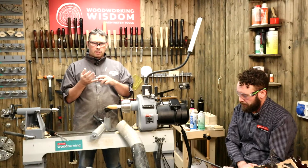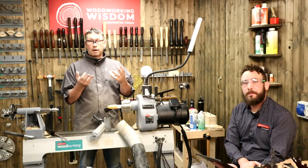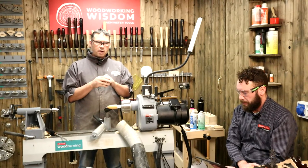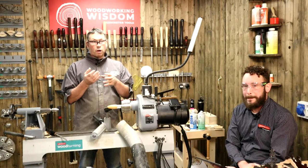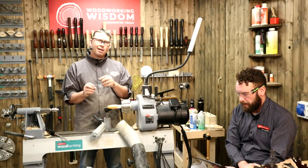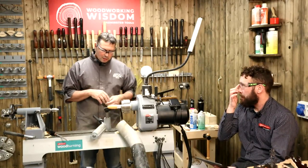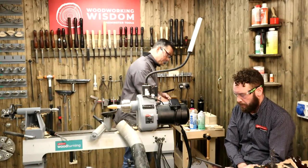If we go in drying times, it'll be cellulose for speed. Then it'll be spirit, because it's a spirit, it evaporates quickly. And then we go water. So that's the time scale. Spirit sealer is like a French polish. It's a dilute version of French polish. That's good. Not my choice, really. Again, it won't penetrate as well as cellulose. And it can be quite sticky as well. Things can stick to it. So my choice would definitely always be cellulose. But we need to see where cellulose goes. In the future, we may not be able to get it. Who knows what happens with that.